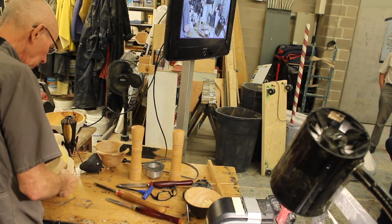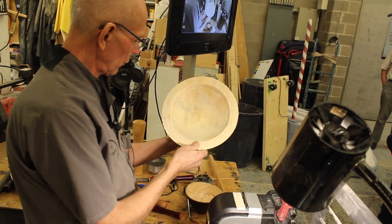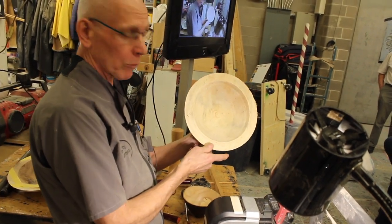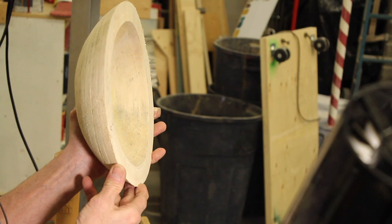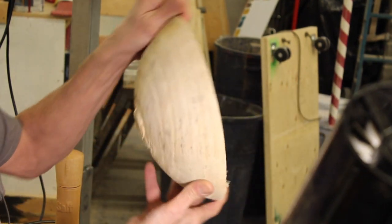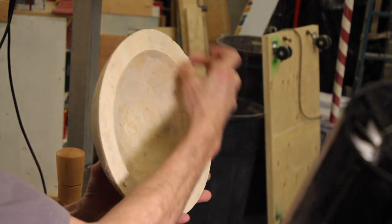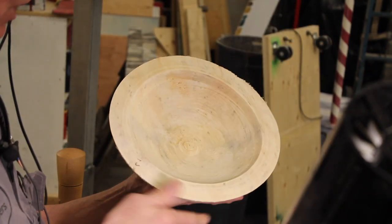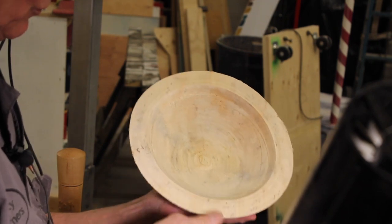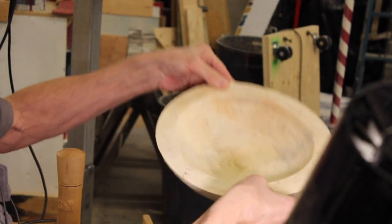If you were going to make a bowl with handles, in many ways it's the same thing. So this is a blank — you can probably see that this is the end grain from here to here, and that has not changed much in diameter because end grain doesn't really move. But in here it's squeezed in. So I've left this thick enough that I could then turn a foot on here, put it in a chuck, and turn the whole thing back round again. Certainly nothing wrong with that — that's one way. The other way is to use this extra length as handles.